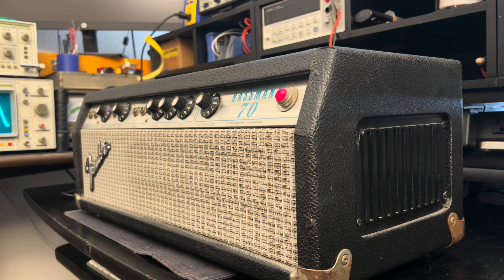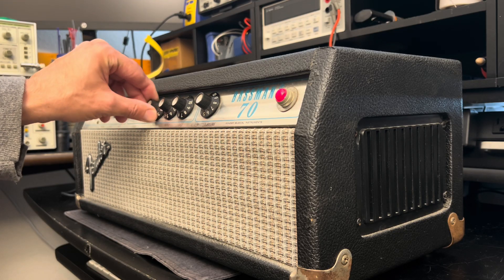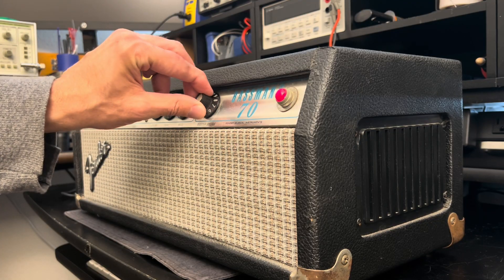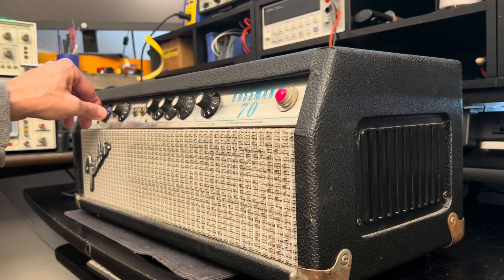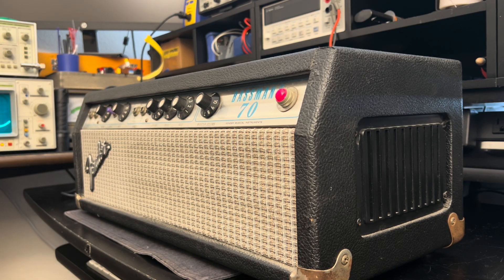There's some crispy 120-cycle noise. We have a little contamination in the potentiometers. With all volumes down, we're getting some power amp hum — filter caps perhaps, power tubes perhaps, or a blend of both. I haven't looked around back — is there a hum balance circuit?